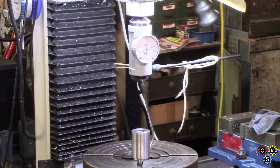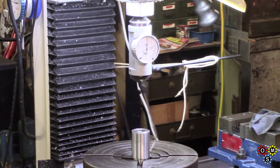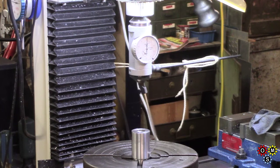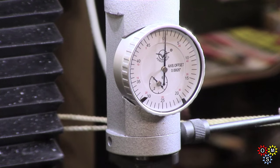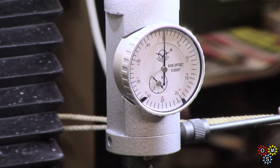I don't know whether you can see much but I've pretty much got it locked down. I've taken a little bit of light off so that you can possibly see the dial. I'm within probably a couple of tenths at the moment, which is pretty much okay. This is not mega critical, but I want it to be fairly good. With each graduation being five tenths, I've only got a deflection of a tenth or two, so that's plenty accurate enough for this job.